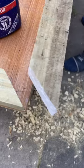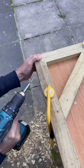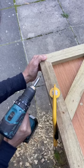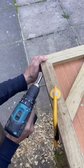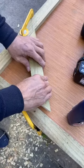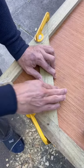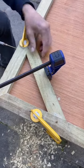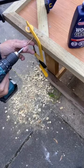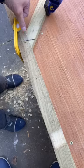Now we can check the joints for alignment and we can start gluing up. Use a waterproof wood glue and put your first screw in — sometimes it comes out again because remember these screws are drill bits. Corner brace at 45 degrees; you'll see the pencil marks to align it exactly. Put a top clamp on with just a tiny pinch of tension to stop the screws pushing the wood away so it all pulls in perfectly at 90 degrees.